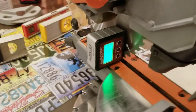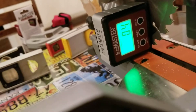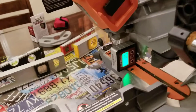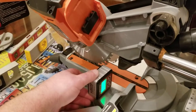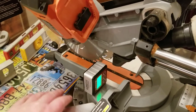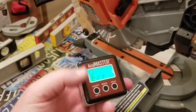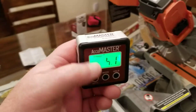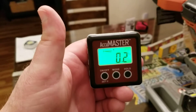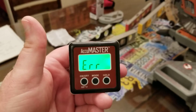You can tell my table is a little uneven. But you can reset this little gauge to recalibrate itself. If you wanted to calibrate it to the actual miter saw, you just hold down the on/off button and the hold button at the same time, and it recalibrates itself. You could also use this little level to set pinion angles on, let's say, a rear differential on a car — that would be really handy.